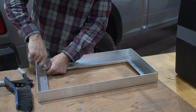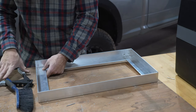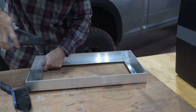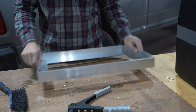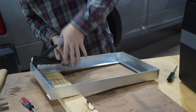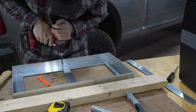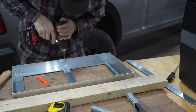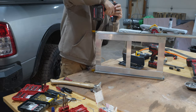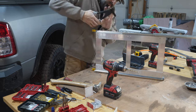It's all about support. The long sides of the angle have to go on the bottom, and you're going to overlap the short side. The long side is then screwed to this crazy 400-pound drawer slide, which is screwed to the cabinet. That means the short sides are supported by everything — the cabinet, the drawer slide, the screws, the rivets, the angle. It can't bend. And the rivets that connect the two angles together — those are just stopping it from moving. All the strength is in the shear strength of the rivets. A three-sixteenths aluminum rivet has a shear strength of like 200 pounds.